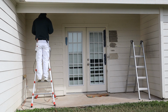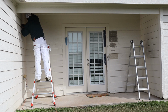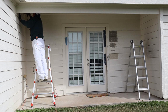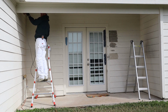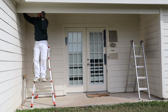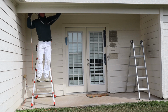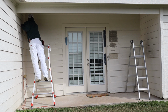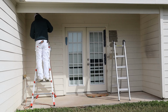And like I say, this area here takes a fair amount of time because there's a lot of surfaces in there that have to be done. There's trim boards in those corners that are smooth that I take the 80 grit to, and I have to hand sand some of that because it's too small to use the sander on. And then I've got the 1x2 trim board up around the top that has to be done. And then that area where I just had my hand, that is on the side I'm sanding right now is textured, but on the bottom it's textured, but the edges have to be sanded by themselves with the 80 grit because they're rough. And when I say rough, I mean when you run your hand over them, they are rough. And then after I sand, they're quite smooth.